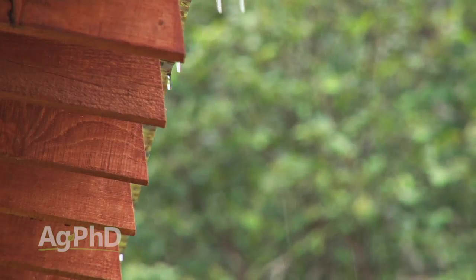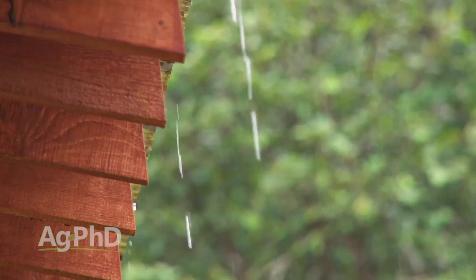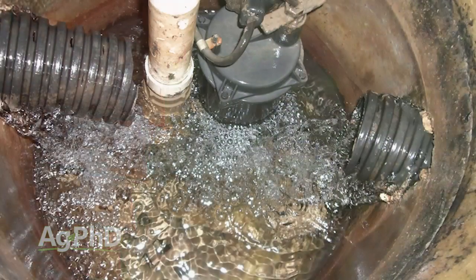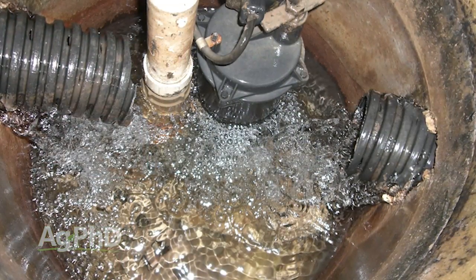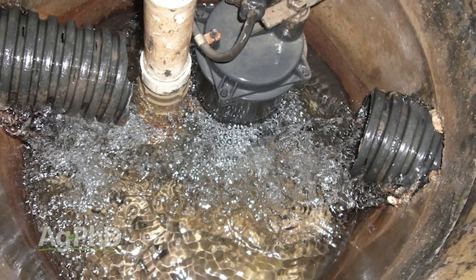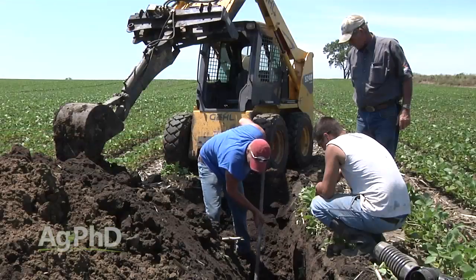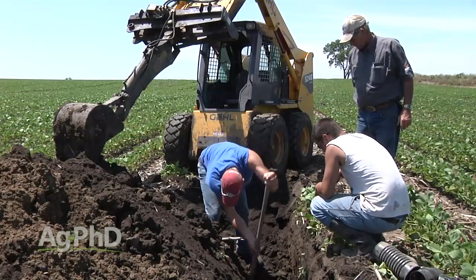The reason why is as water moves up and that water table rises after we've had too much rainfall for a long period of time, then the drain tile can fill from the bottom up and that water moves through the pipe and into our sump pump so we can get rid of excess water before it soaks our basements. When we look at drain tile out in fields, it works much the same way.